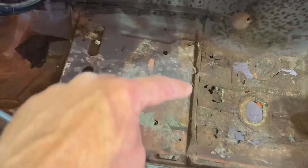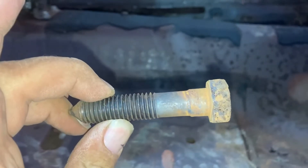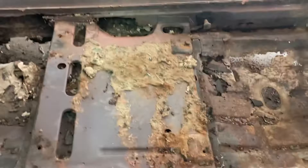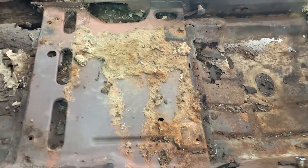All the under-bracing has been welded in and put in place. The next step is to get the seat bases out — particularly the driver's side, because it's salvageable and in pretty good condition. The passenger side, on the other hand, I'm probably just going to cut up to get it out of the way. I've actually unscrewed the body mounts. Normally those bolts are rusted 100% away, so it's a shame this car has floor pans as rusty as they are because the rest of the car is really not too bad. Next step: work on getting these seat bases cut out of here.